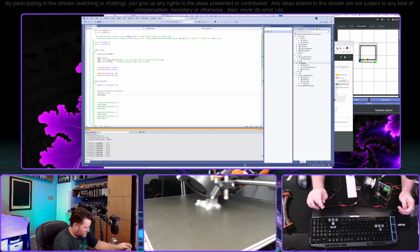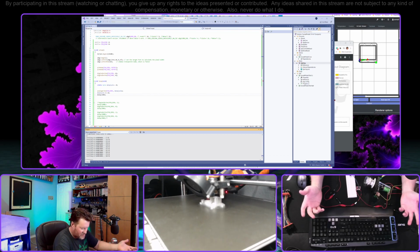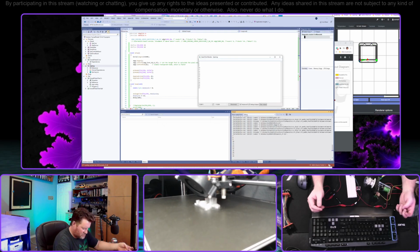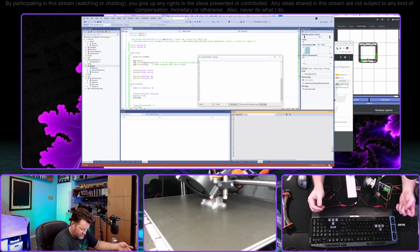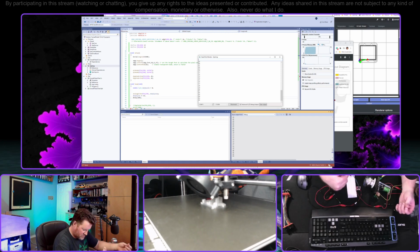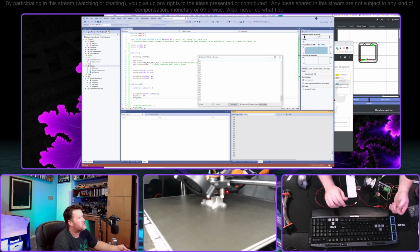All right, so what do we have so far? I'm sure we can get 5 volts. This could also run at 12. There's no reason why I can't, but get that directly off of the table. So if I were to put this on a PCB, I would need the H bridge. I would need a step down converter for the microcontroller. I could actually just use one of these modules probably.